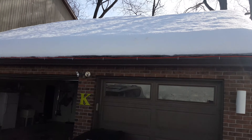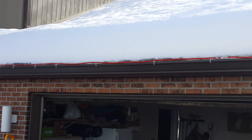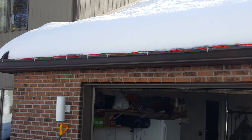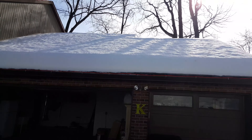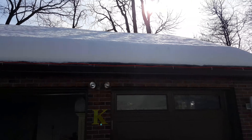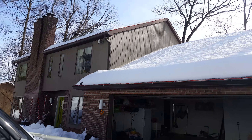With no sun out here, and days in the upper 30s and nights in the low 20s and teens, you're getting freeze-thaw, freeze-thaw cycles. There is actually some ice starting to form on the edge of the shingles. I don't have a gutter guard on this particular gutter — I did have one on the back. Gutter guards are a good preventative; they won't necessarily stop the problem but at least prevent snow from getting in the gutter. If I don't get this snow off the first three to five feet of this roof, I'm going to start getting water backup. I can already tell from the way the ice is starting to sheet — that's a big block of ice.